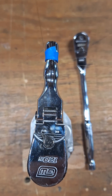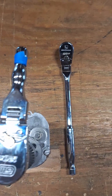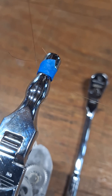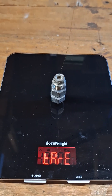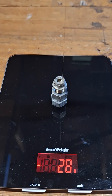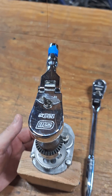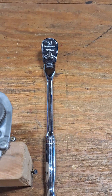Let's see how close it got the back drag torque to the measurements we got on the one on the right — the one on the right is made in Taiwan, this one is made in China. We're at three and five-eighths inches for support and three and five-eighths inches for pull. Let's go ahead and zero the weight and actuate. We got 29 grams. We'll be able to calculate the back drag torque for this Chinese-made ratchet and compare it to the Taiwanese-made ratchet that we already measured.